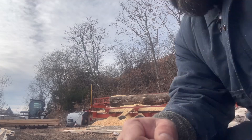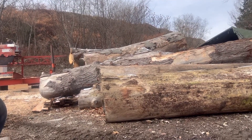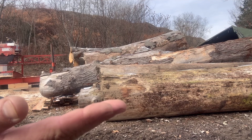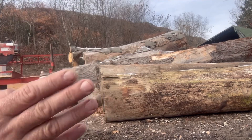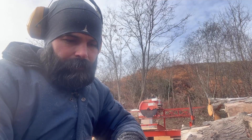There's not much left of this log but I have a lot more wood. We've got a pile right here of white pine and then there's a hemlock I'm going to try to make into clapboards by moving the log every cut — lifting it up five degrees, cutting, dropping it down five degrees, cutting — adjusting the orientation of the log to cut clapboards with this saw. By the time I return to the saw I'm able to reset it and send it again — all down to a millisecond. The man that designed this saw is phenomenal.